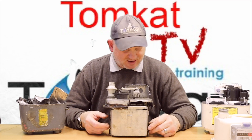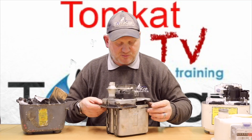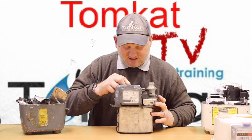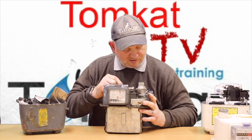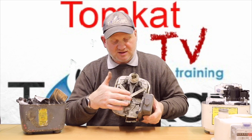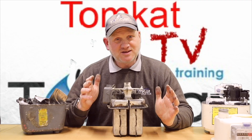There's not that much difference in this one compared to the other one, except that this is made of stainless steel. I can't do my trick with the vacuum cleaner because this is sealed to the bottom. But it still moves in exactly the same way — you can see it's still exactly the same. The finger is going round. The only real plastic bits are the chambers and these two connecting rods. That's what a gas meter from the 1970s looks like on the inside — it still has four chambers.